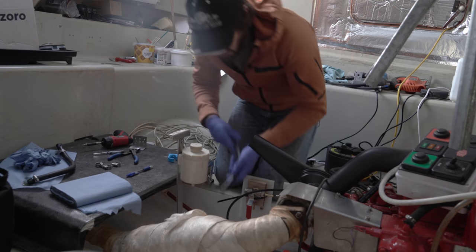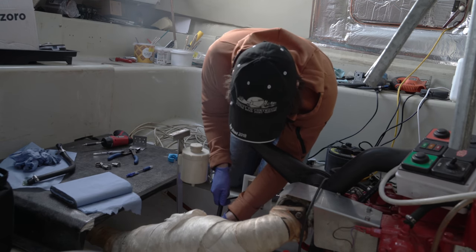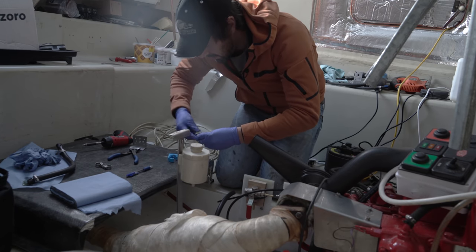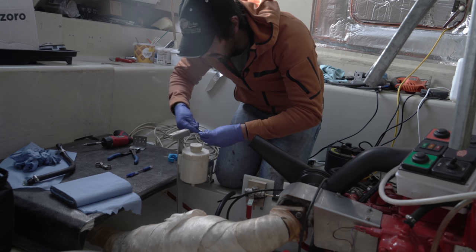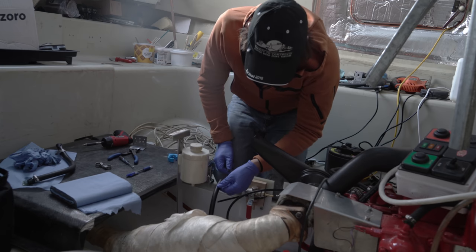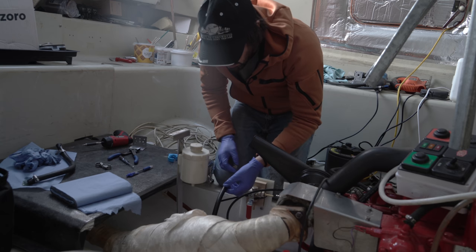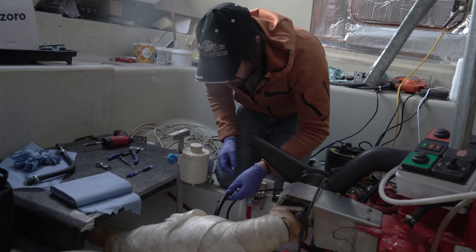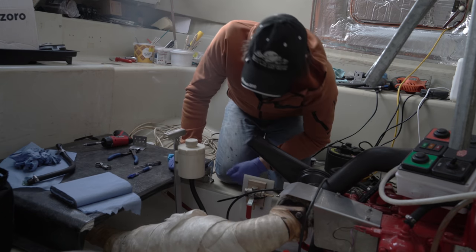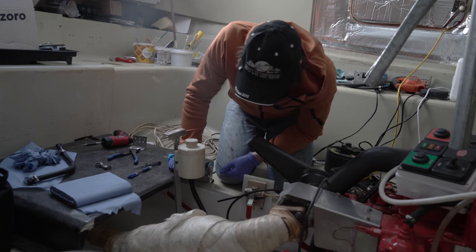Right, so this hose is a couple of millimetres larger in diameter, so this should now run on quite nicely. Yep, there we are. I haven't decided, because this is not a fuel line, this is only an oil lubricant line, whether I'm going to use O-clips or whether I'm happy with Jubilees. Originally it just had one Jubilee at each end, so they clearly weren't too concerned. So there we go, this is fine for now. I might change these over for O-clips at a later date, but I'm very happy with that at the moment.